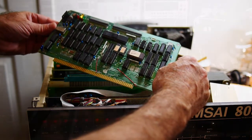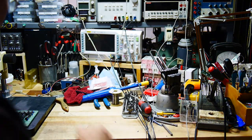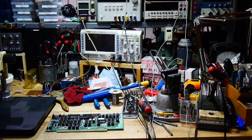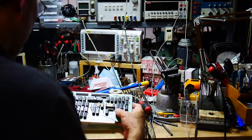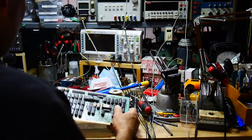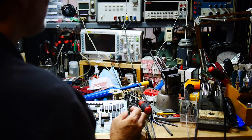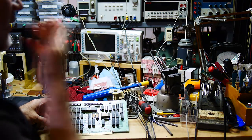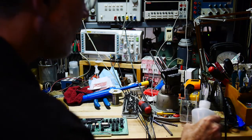While we're at it, we might as well replace them. This is new for me — I haven't filmed out here ever, so I hope you can see things. So here's the card. There are four capacitors here. Let's go ahead and heat up the iron. I have it on a timer set for 30 minutes, so in case I forget to turn off the soldering iron it automatically shuts off for me, so I don't catch things on fire. Not a bad idea — I would recommend it.